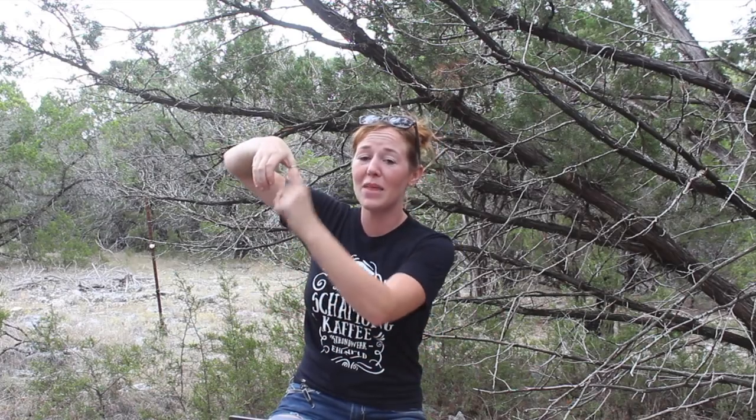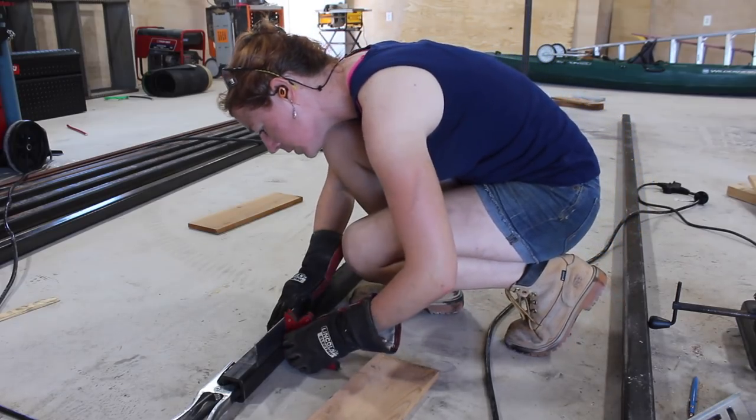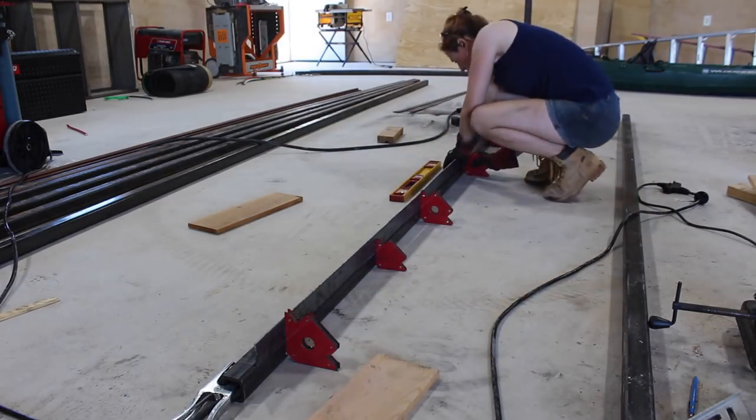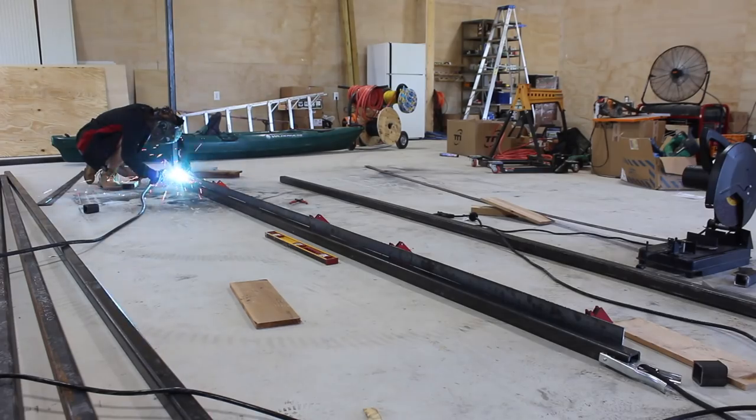A few things about having a giant wooden slab center — the wood will need room to expand and contract. I consulted with master craftsman Philip Morley and he suggested incorporating a U-channel design to hold the wood, so it would be held at the bottom but have room at the top to allow for wood movement. I had trouble finding the right size U-channel, so my welder friend JD suggested I just make my own using flat bar. Perfect idea, so that's what I did.